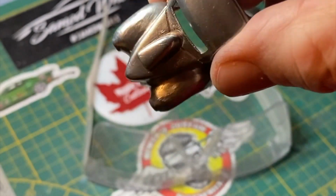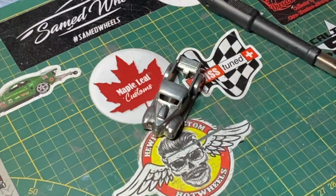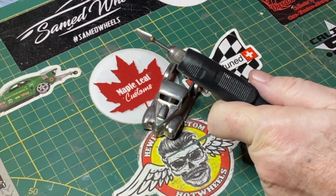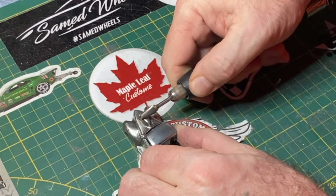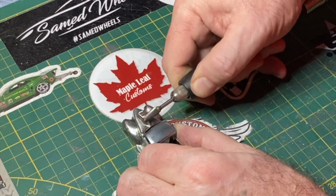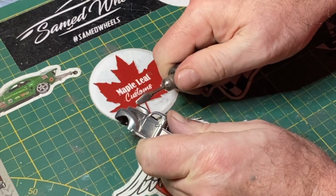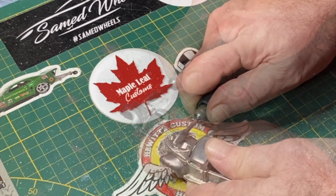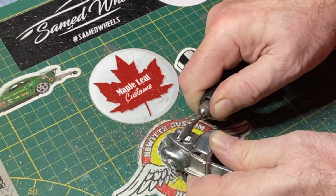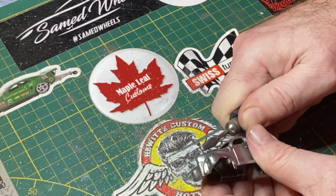And now I want to get rid of this bulbous blower that's been cast into the body. That's a modification that Hot Wheels did in this most recent release in 2022. I take a titanium-tipped burr tool, and off it comes. You gotta use a King Kong grip on both the casting and the rotary tool so this one doesn't jump and scar the rest of the casting, but I had some good luck today. It's really not a fair match. These titanium tools make fast work of diecast.